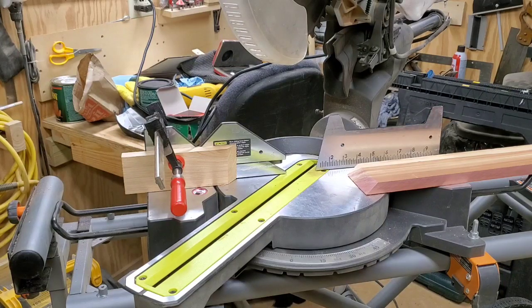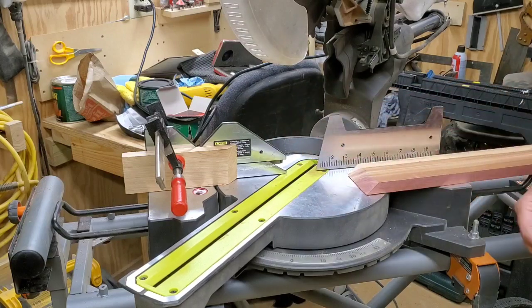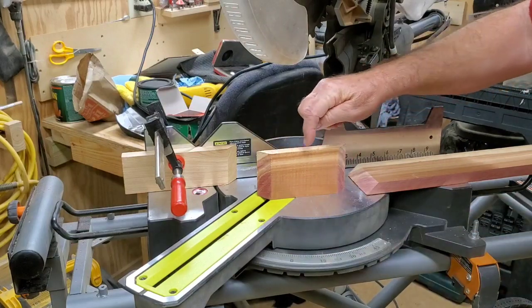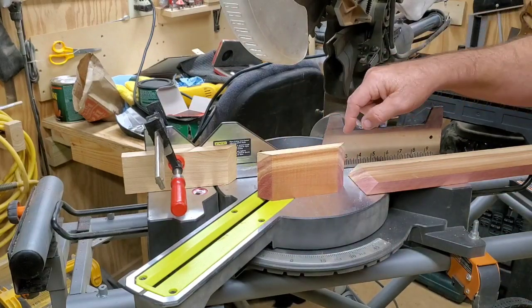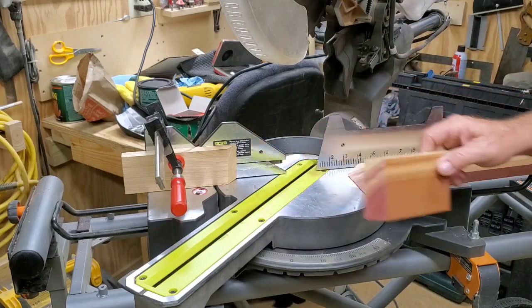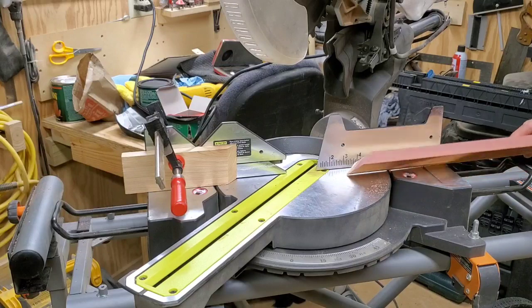What I need to do is cut the exact same inside dimensions as the existing box. So what I had to do was calculate the distance between the bevel cut here and the bevel cut that will be right here, so that I get an exact dimension from here to here, and that will duplicate, when all 4 are done, the exact inside dimensions of what the customer has requested. So laying this jig out here simplifies the cuts for me.